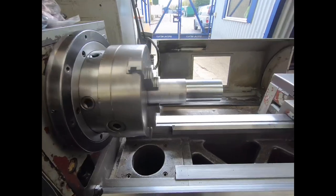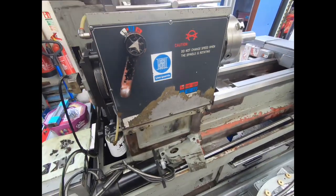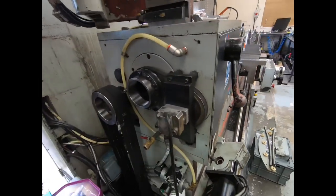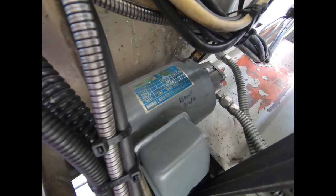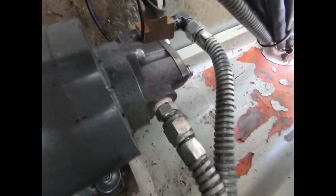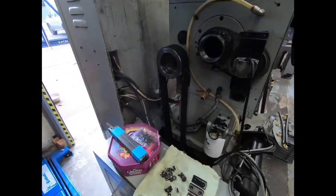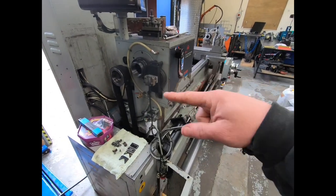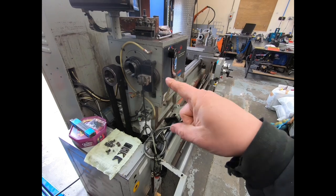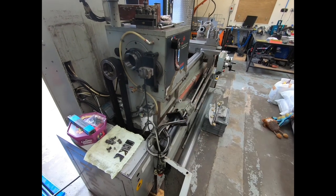I think it's been put to auction because the bed's worn and everyone's abused it. The wipers on there were just destroyed and no good for nothing. The reason the bearings are so bad is these machines have the headstock and bearings fed by an oil pump continuously. That oil pump — the bushings in it were shot. The reason I lost my 16 litres of fluid was because that pump was knackered. The seal was completely out of shape where the shaft was completely misaligned where the bushings had disintegrated. It was whipping around and the oil shaft seal was egg-shaped, so it allowed the oil to just run out.